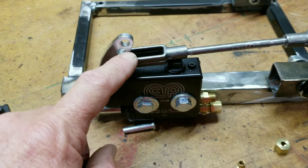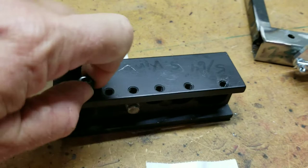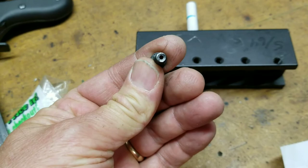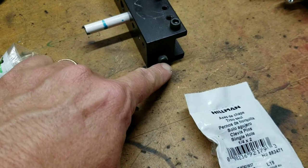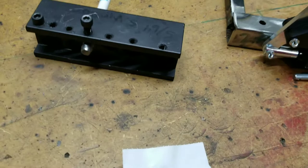This tool is pretty neat — I think I got this from SoCal or Summit Racing. The bolt puts in here; this is designed for drilling safety wire holes in bolts. You take this little Allen-wrench-head piece — there's a hole in the center of it — and screw that into the hole above the proper size, and that clamps the bolt in place so it doesn't slide back and forth. Then you take a 5/64 drill bit and drill down in there. It comes with drill bits hiding inside an access hole on the side. This is great for putting safety wires. I think it goes up to 5/8, so you can actually do an axle bolt on this one if you wanted to.